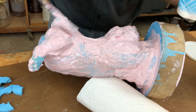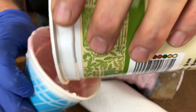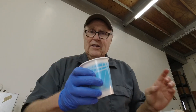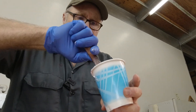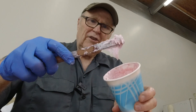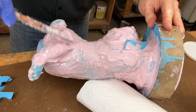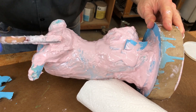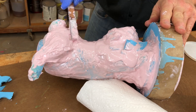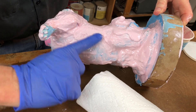Now that area is getting really nicely filled up. Another thing I can do besides adding solid chunks is add polyethylene mini fiber — this ultra-fine powdery plastic acts as a thickener to make this peanut buttery resin even more goopy. As you can see, it really does make it goopy. You can mix it to the point where it's practically a thick paste, but we don't need to do that. So we're just going to keep applying this stuff, and it really stays in place with the added mini fibers.